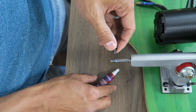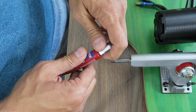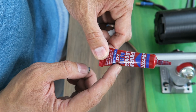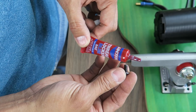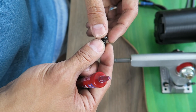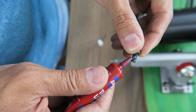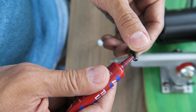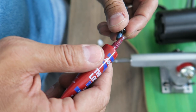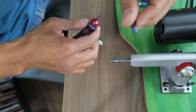After tinkering around to get the right belt tension, I'm adding thread locker — blue thread locker acts like a glue or hardener on the threads. Add it to the bolts connected to the motor and pulley, because it's super key to making sure bolts don't loosen from the motor's vibration. Just a little bit goes a long way — add it near the bottom of the threads, then screw everything in as desired.